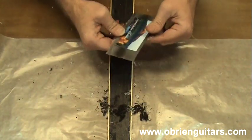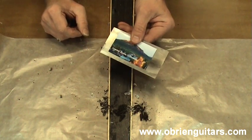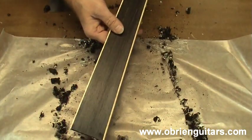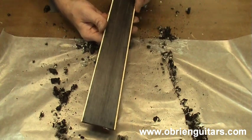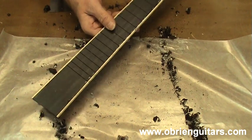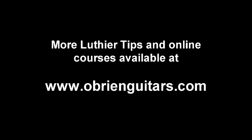And if it's a Crested Butte, Colorado picture magnet for my friend JC in Crested Butte, it works even better. Once you get done scraping the bottom of the fretboard, that's what it looks like — no gaps, binding is attached to the side, and it's not coming off. Now I can go ahead and glue it to my guitar and then come in and level and radius from the top side. So John, thank you for your question and I hope you find this information useful next time you need to attach the bindings to the side of your fretboard. Happy Binding!